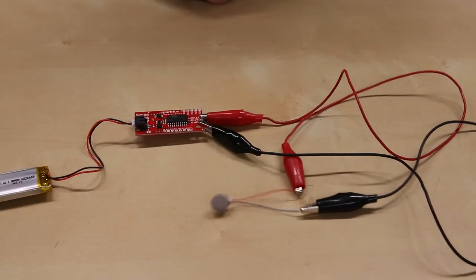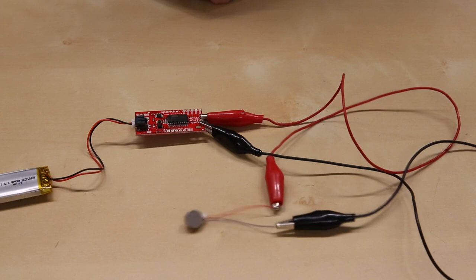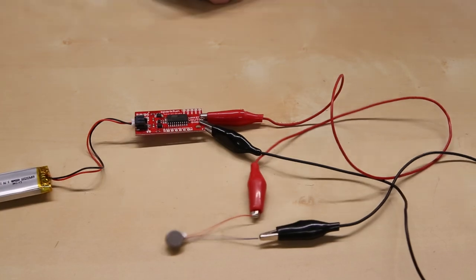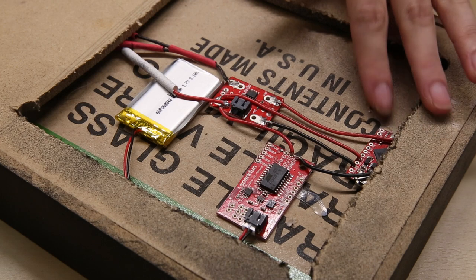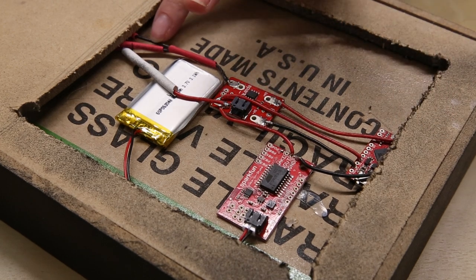Here's a simplified version of the circuit. The Wake On Shake interrupts power until it moves — in the case of our bug, until the glass gets tapped. Then the Vibe motors get power, buzzing the wings. On our final project, we added an Arduino so that we could have a pattern in the buzzing of the wings, and also a MOSFET, which gave us enough power to move two Vibe motors instead of one.